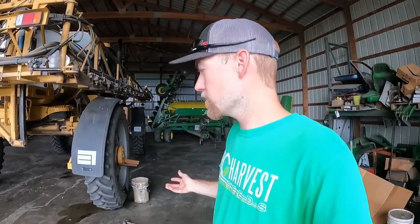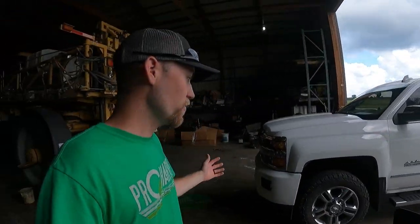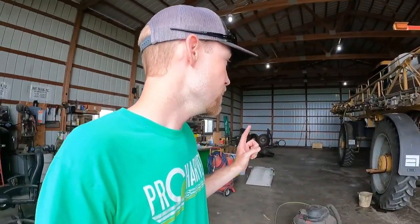So I started draining the oil the other day, thought they took 80, 90 gear oil, but they don't. They take 75, 140 synthetic. So I had to go get a bucket of oil. Needless to say, I couldn't finish the job. So I got oil now. We need to finish that. I also need to change oil in my pickup. And then when we get that done, we need to get this stuff out of here and bring the combine in the shop because it's getting inspected tomorrow.